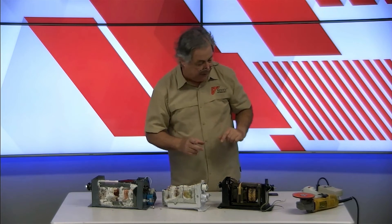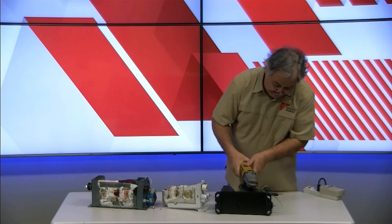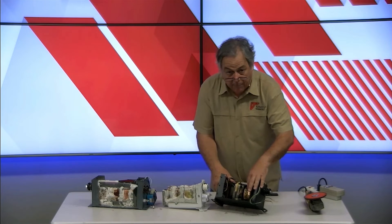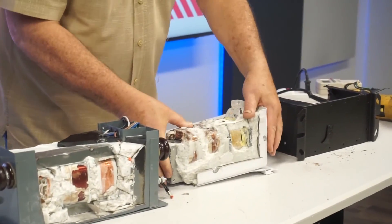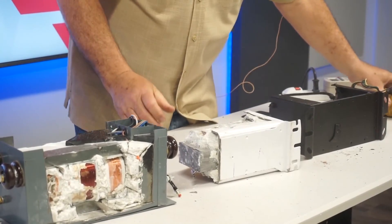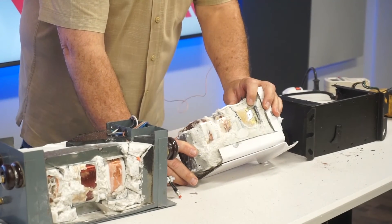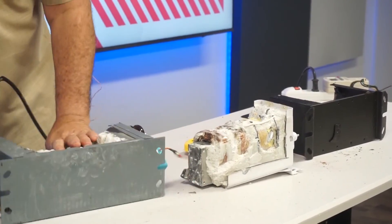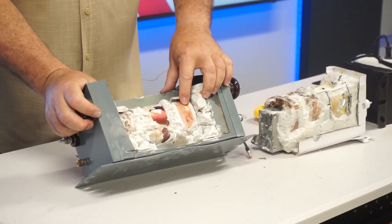The other main thing we should look at is what it's made out of. You can see the tape that's around here, holding together the windings on the primaries and secondaries — but again, you can see just how small the primaries and secondaries are on these. Looking inside the second unit, we see that on the secondaries it is copper windings, but on the primary these are aluminum windings. Aluminum doesn't have nearly the energy carrying capacity that copper does.